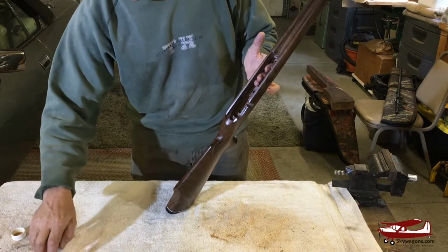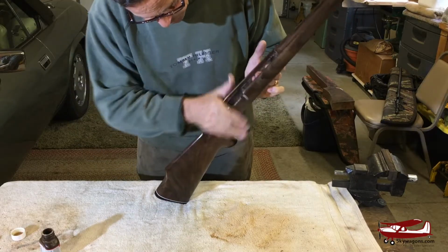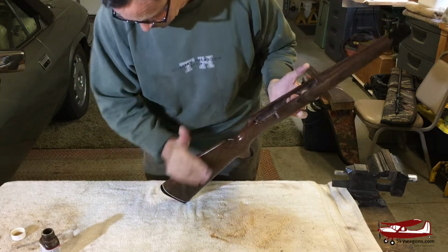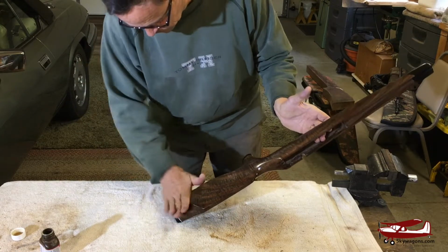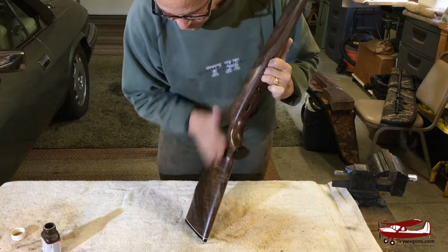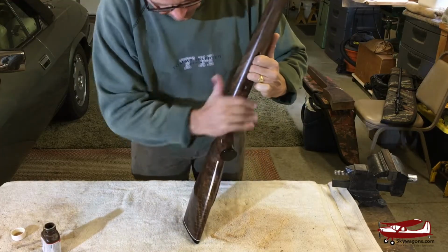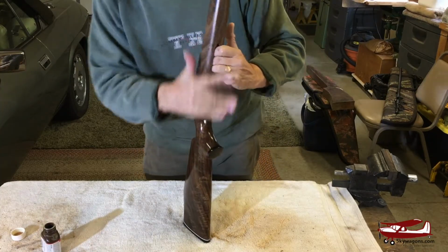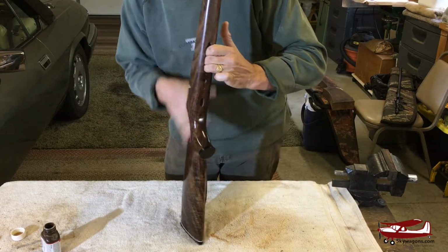Dry enough for another coat. So just same thing, concentrating on any areas that are thin. This second coat is going to get a bit draggier a bit sooner because it's got the other coat under it. So just go on it quickly while it's still slippery. And never too much. Once you put it on there, you're actually trying to wipe it off. So you're thinking, too much, I've got to get rid of that.